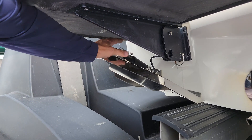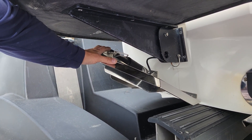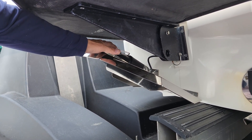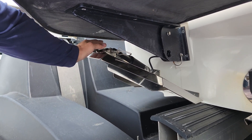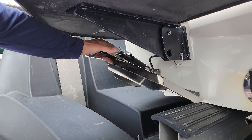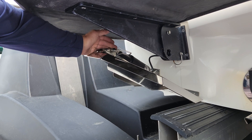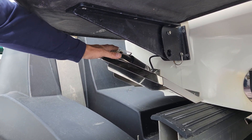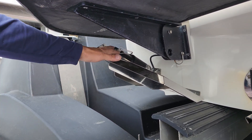Now we have to remove this actuator. We're going to bring the tab down and release it from the actuator. Mastercraft uses a quick disconnect or quick release pin — some manufacturers will use bolts, so depending on what you're on you may need a ratchet or open end wrench. There are two spacers in here on each side; what that does is keep this actuator from hitting the corners and damaging it. I can't drop these because I'm on the water and they do not float. We're going to bring the tab down and remove this actuator.